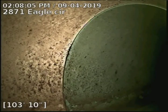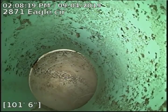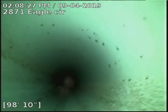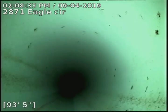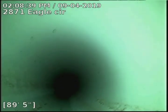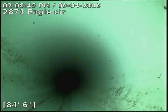2871 Eagle Circle — doing a sewer scope from a three-inch basement clean out. Looks like we're about 103 feet to the city sewer. There's our tap connection into the main, SDR 35 piping on the exterior side of the home. That's the green plastic material we're looking at there. I ran the upstairs wash sink in the mudroom off the garage to test the line — that puts out quite a bit of water.